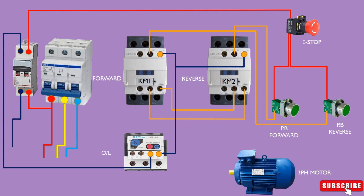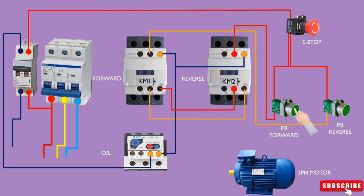Here is only the control circuit so you can easily understand. The neutral wire through the overload relay is already connected. The phase is connected through the e-stop and then to the forward and reverse push buttons. When you push the forward button, the power goes through the reverse contactor's normally-close interlocking point to contactor KM1. When KM1 turns on, that interlocking point opens so no current can cross from that side.